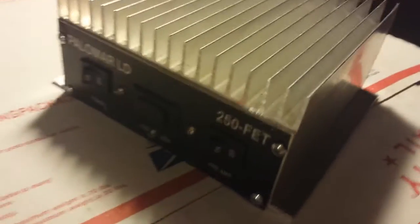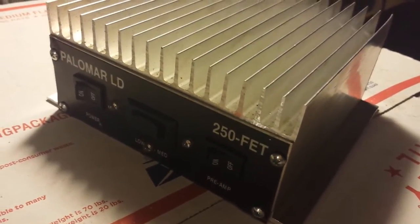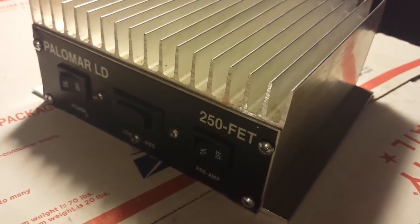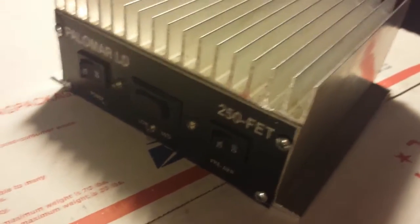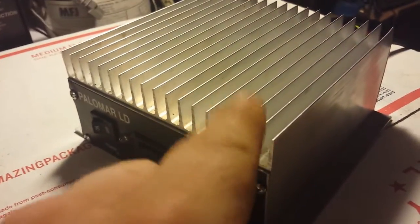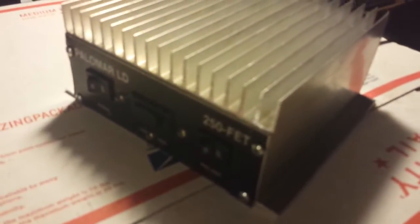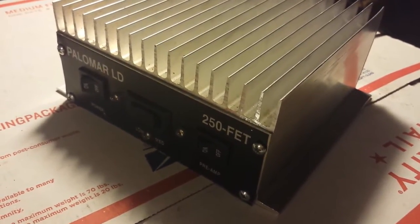What I did was I converted it to the HD version. I went ahead and rewired it and I had to retune the input. Because the way this was tuned, you had an extra tuning section, which is on here. It appeared that the input was tuned a little different on this version than the HD version because this section is in here. So I threw a little trimmer and retuned that, and got her working — working real well, doing what she should be.